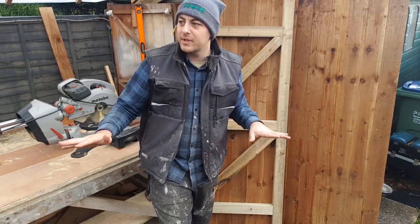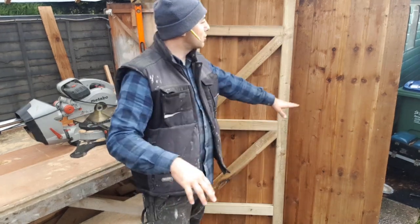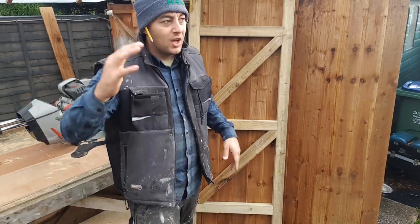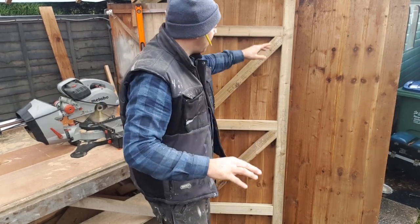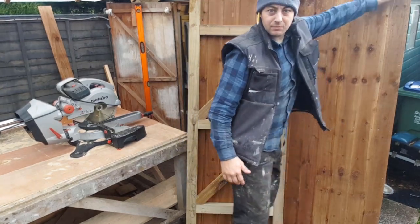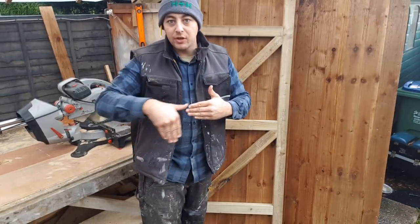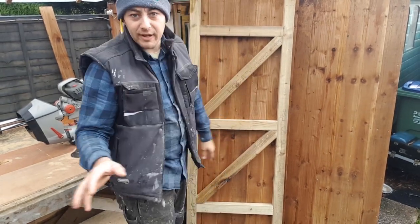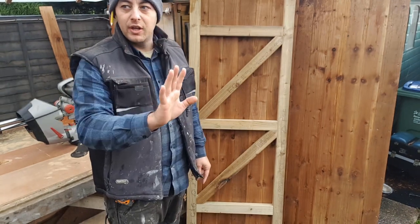Okay then folks, I'm going to keep this real snappy because it's wet, it's cold and it's windy. They're all done now. I'm going to replace the screws with nails when I get them, probably when I get to the job site and fit it. Might try and video that if I can. I've tried to play it a bit crafty - I've left an overlap on this side of the gate. So when this one closes, you just have a complete run of feather edge and they're all four inch spaces. Hopefully that should look quite nice. Hinges are going on the back so you shouldn't see anything - it should just look like a feather edge fence.